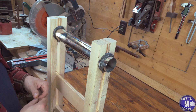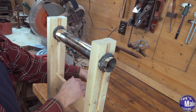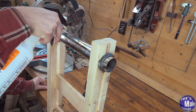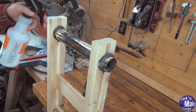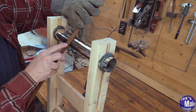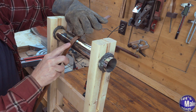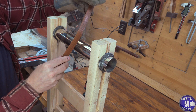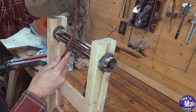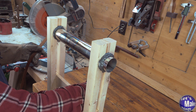The process is very straightforward — we heat up the pipe and bend stuff around it. I'll start the torch, lock it in place, and insert it inside the hole in the back. We'll give it some time to warm up — you can see it bouncing off the surface when it's hot enough. All I have to do is press the wood on the pipe and push down. I'm already getting a bend. I'll keep spraying it — that's really the trick. I'm getting a little burning on the back, so I'll lower the flame a bit.